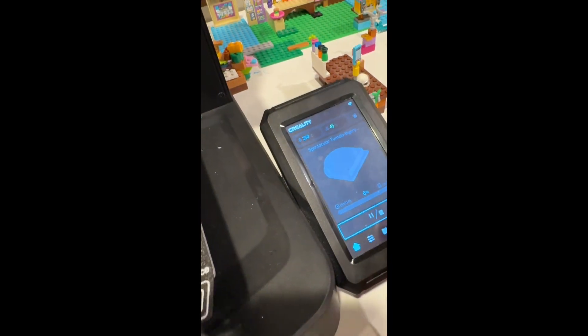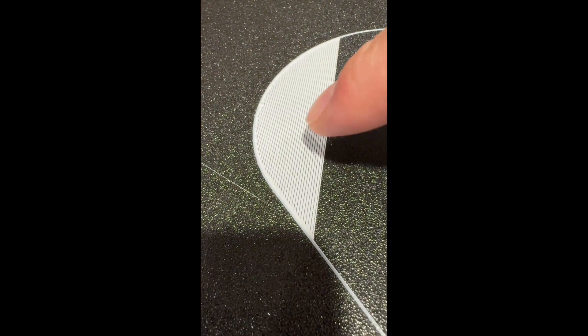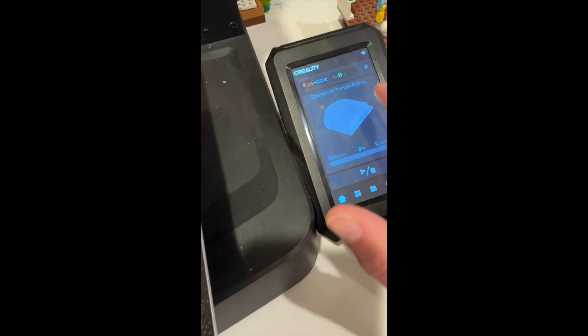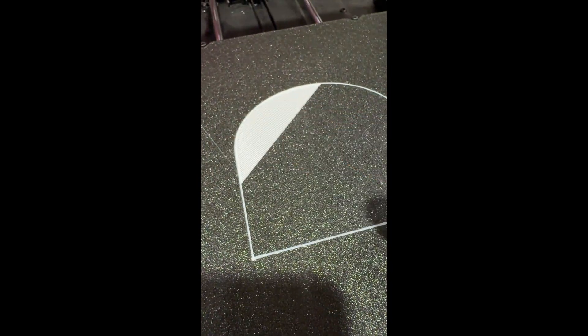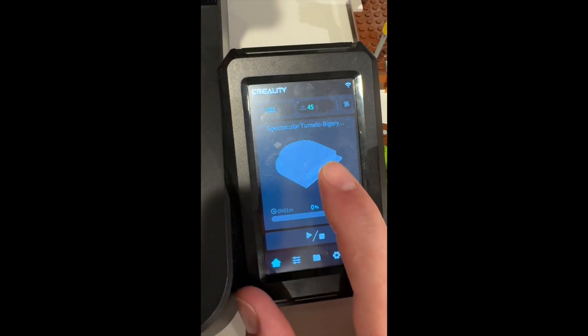So this is what my prints were looking like. Find something with a large flat base so you can see the first layer clearly — I'm going to pause this real quick just so you can see. Even after auto-calibrating or auto-leveling every time, that's what my first layer was looking like — see how spaced out everything was? What I would do is find something flat to print and check this. If you go on Thingiverse, there are even test prints. I was just using the base of some trophies I was making.